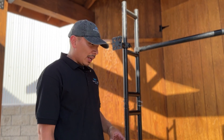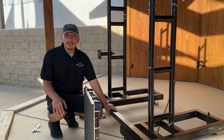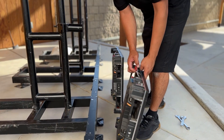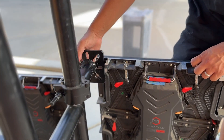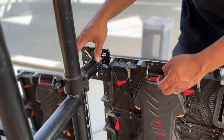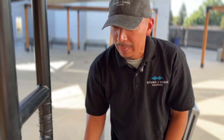Just to reiterate, for safety purposes, you want to make sure that your front base is level. This bar right here is going to make or break the way that your LED wall sets up and its long-life durability. For this installation, I'm going to go ahead and use two of our outdoor P391-rated panels and show you how to get started. You'll receive a box of screws that are going to go along with these brackets, which you'll mount to the outsides of your system bar. These are going to line up right here with each panel. I highly recommend you only get about three to four turns in — you don't want to go all the way tight. You're going to tighten it at the very end once all the panels are complete.